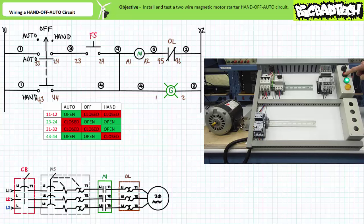Note the motor does not energize because the manual motor starter is open, thereby allowing us to functionally isolate the pilot and primary circuits for test and troubleshooting purposes. When the simulated float switch opens, the contactor opens and the pilot lamp goes off. When the three-position selector switch is rotated to the hand position, the contactor closes and the pilot lamp comes on even though the float switch is not activated — the hand position allows an operator to override the automatic system or bypass a malfunctioning float switch.